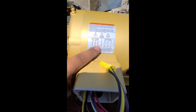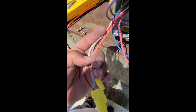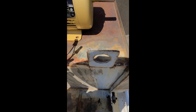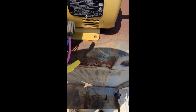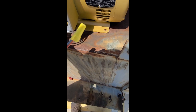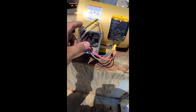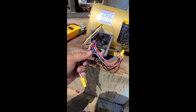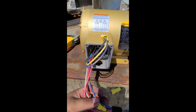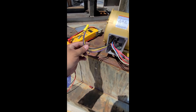The dots are connected from eight to two and seven to one. So nine to three is orange and gray right here. Eight to two is red and blue, and then seven to one is the pink and blue. Colors don't matter — what I did is I already tied them. So there's now one bundle with three wires and two bundles with two wires each. The four-five-six bundle with three wires just sits in there and goes away.